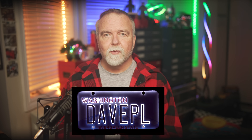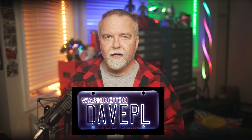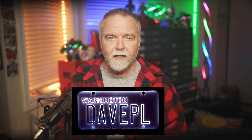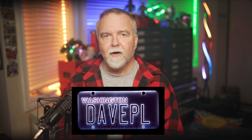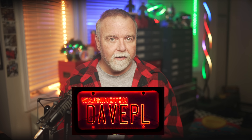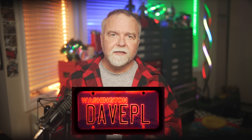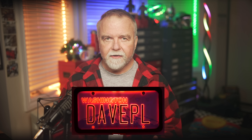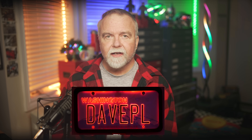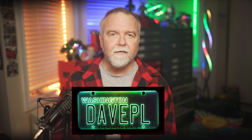When it boots up, we see the frame rendered in a nice white outline — this is using just the W portion of the LEDs, giving a bright, natural white. To change the effect, we press the big button on the M5 module and it steps through the various active effects. The next one is simply a pure red, followed by a pure amber color, and then a flame effect. The flame effect ignites sparks at the center of the plate which bloom outwards, slowly cooling as they do. After that comes a nice color wipe, with the nicest looks coming from darker colors that give the plate a high contrast background and bright letter outlines.